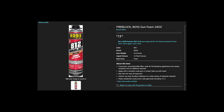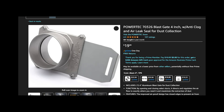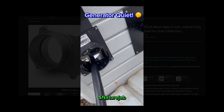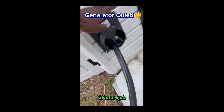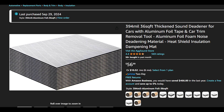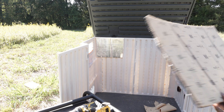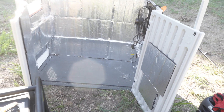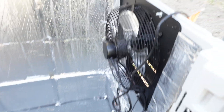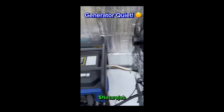You've got your vents and then you just need some fire block — about $10, cheap and easy. You'll also need a blast gate for your 50-amp cable to pass through. I got a 4-inch blast gate but had to cut the handle off my 50-amp plug to make it fit, so I recommend getting a 5 to 6 inch one if you can. The last thing you need is some type of sound deadening and heat shield material. I have one from AG Sound for $57 — it has aluminum foil on one side and sound deadening material on the other. You need something between the plastic and the generator to keep heat off of it so the plastic doesn't melt or catch fire.